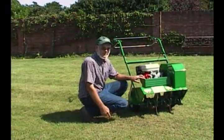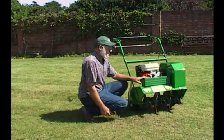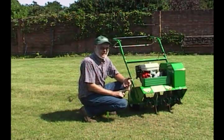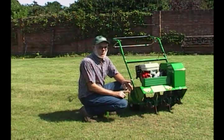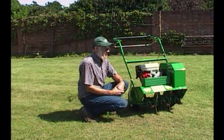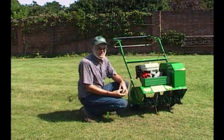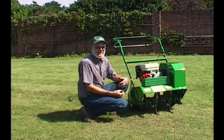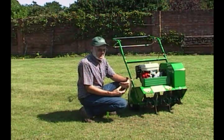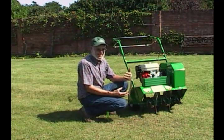One of the nice improvements that make this machine interchangeable tines are available. And one of the best tines we've found to address things like very stony ground, very compact ground, or a customer base that does not wish to have small cores lying on the ground, which you would normally have to pick up. And this is very important for contractors. Often we get into some pretty prestigious lawn areas, and aeration is something that the customer requires in service, but they're very detrimental to you leaving these small cores, which, if it's a clay-type core, could bake, and they are undesirable from treading on the lawn and a safety factor. Also, a lot of customers are concerned about them tracking into their home.